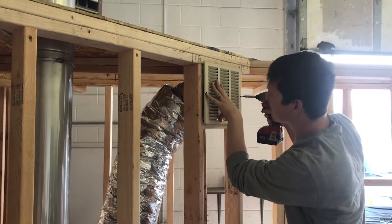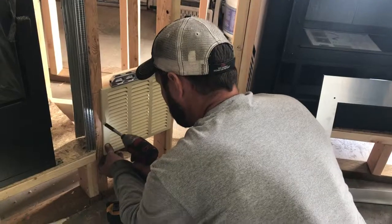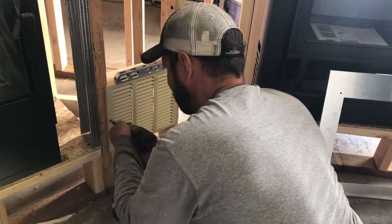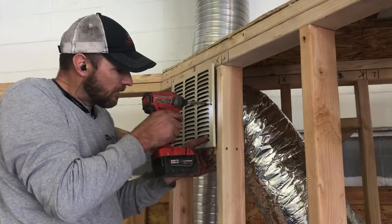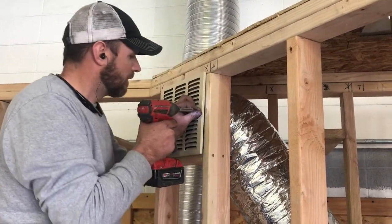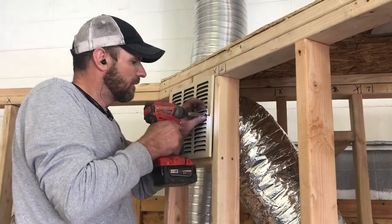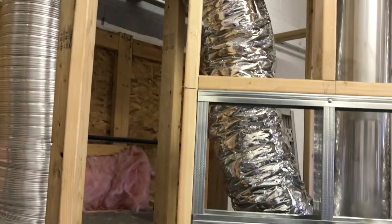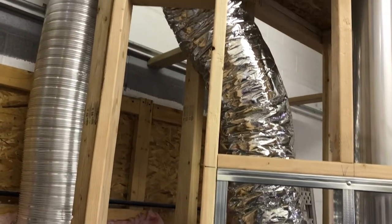Connect it to the bottom opening on the fireplace. There are two gravity ducts, one on each side, and there's also a vent opening for the bottom on each side, making a total of four grills. These gravity ducts actually make the fireplace more efficient — it moves a good amount of air through convection, so there is no blower required. The heat will just move through those ducts as the fireplace heats up.